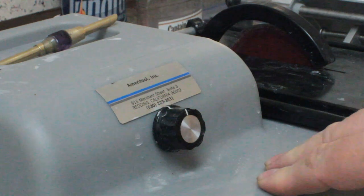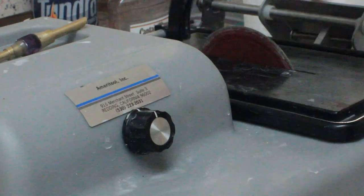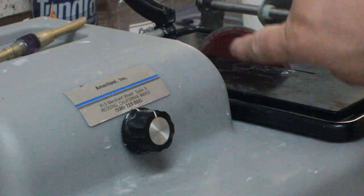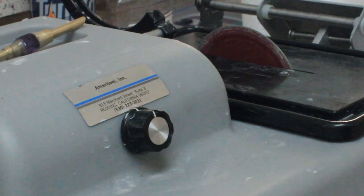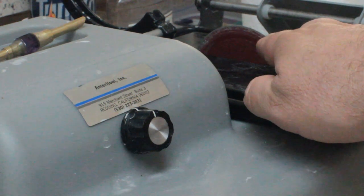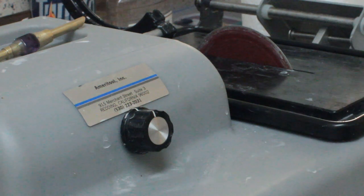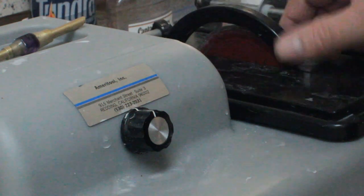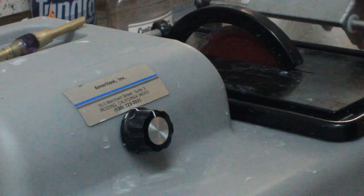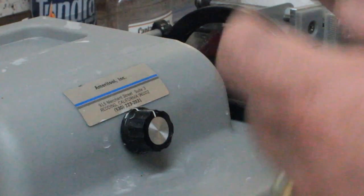This tool I run at full speed. It's meant to run at full speed. The saw blade that I use is a sintered blade, which means there's diamonds throughout the top part of it. So when the first row of diamonds is ground down, another row is revealed underneath. This is to keep the water from splashing. This is an optional part that you can hold the stone with, and I'll set the stone up.